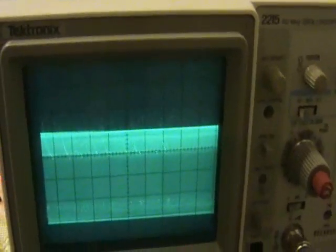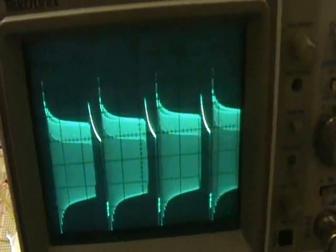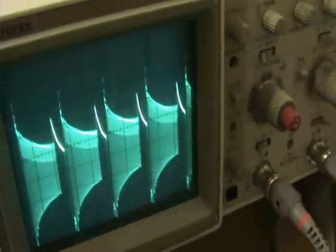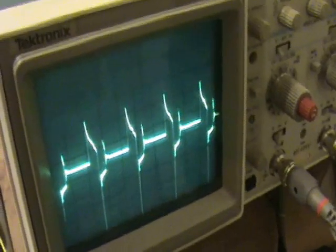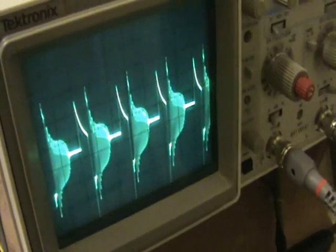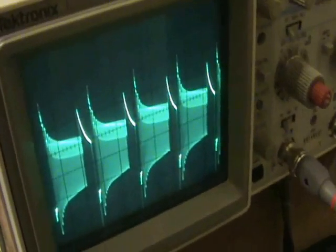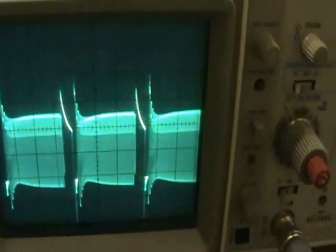As I increase the frequency, we can see a more dramatic dampened oscillation. If I increase the load by turning the variable resistor, it can cut it right down. There's a sort of a balance that you could strike — you'll notice as I move the resistance around, there's a balance in terms of load where you could exploit this ringing.